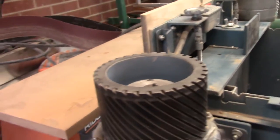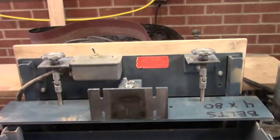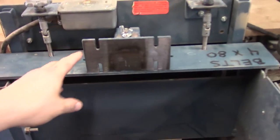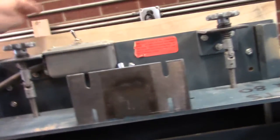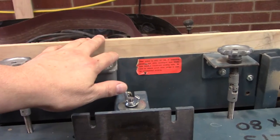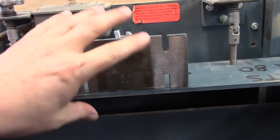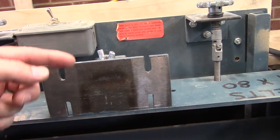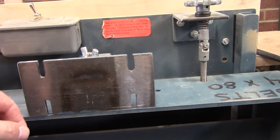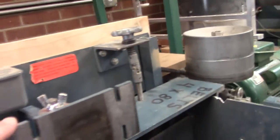Right now it's a four-by-eighty belt. The interesting thing about this tool is that the off-edge side is actually intended to be used just like the edge side. On most modern tools you're not supposed to use the other side, but on this one it has this plate here and you were supposed to be able to attach something — like we used to use it for radiusing, and you could make moldings and that kind of stuff with it.